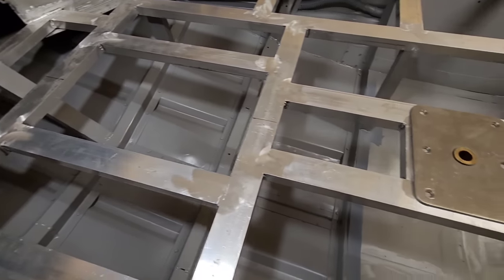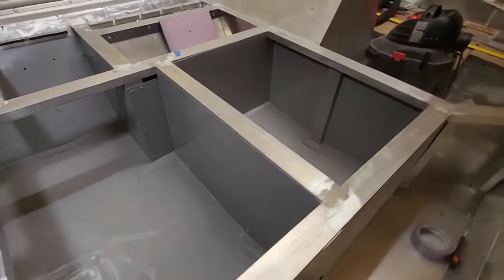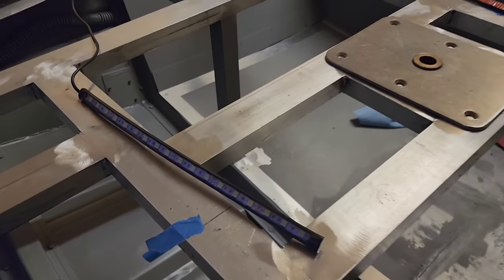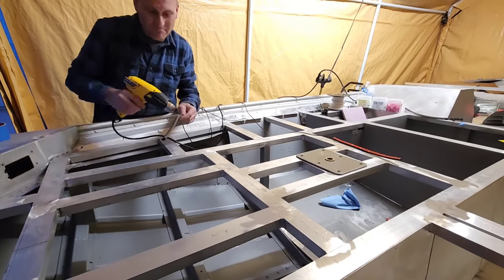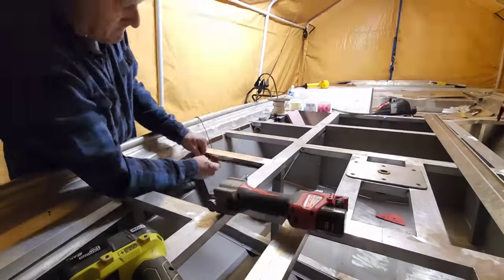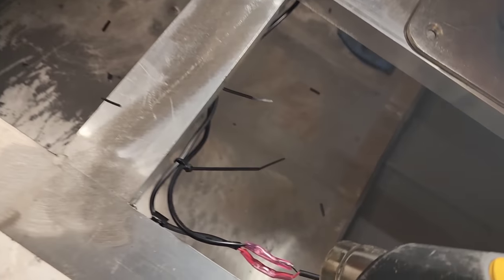The factory hull and all the interior deck vertical walls got the same gray paint treatment as within the back deck. From there, we began roughing in wiring leads for future accessories and wiring in all of the LED light strips within the hatches. Each hatch, including the rod locker, would get ample lighting from these strips with all the wiring hidden underneath the framing and going back to the fuse box location.